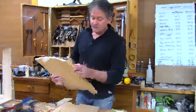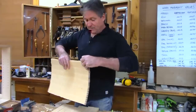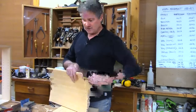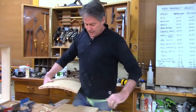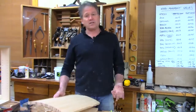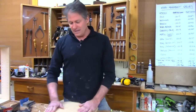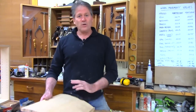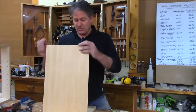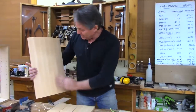It's an older technique, and I've only done a couple. I've done some restoration. But it's an acquired skill because a lot of it is temperature related. As soon as hide glue cools, you lose it. So everything has to be warm. Hide glue's warm, and you hammer it on. I may do some practice one of these days and share that method with you because it would be really fun. But look at that.